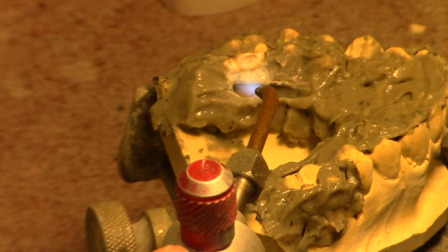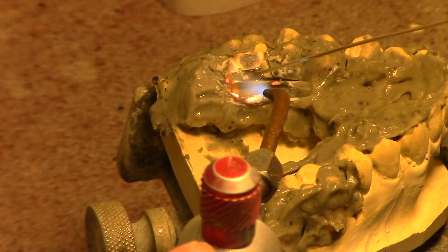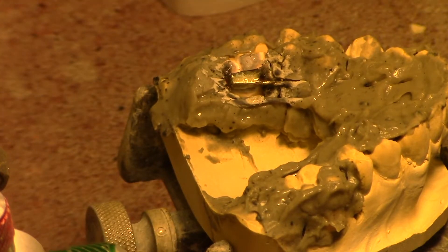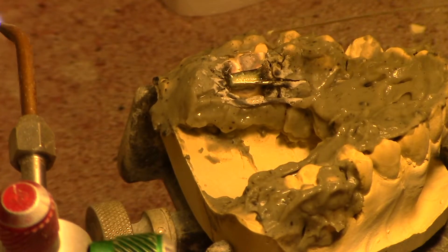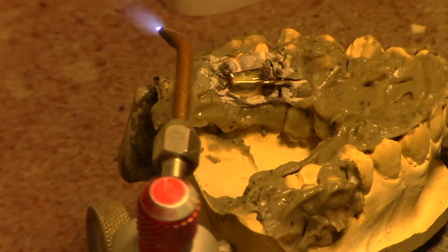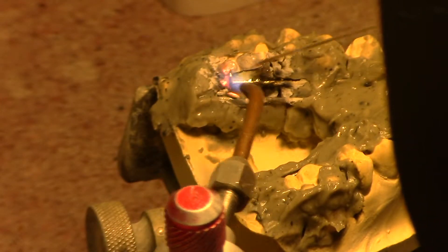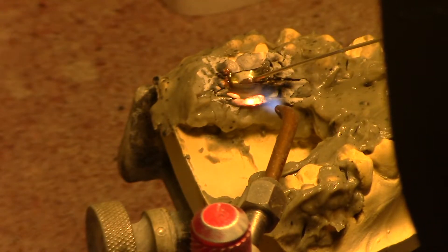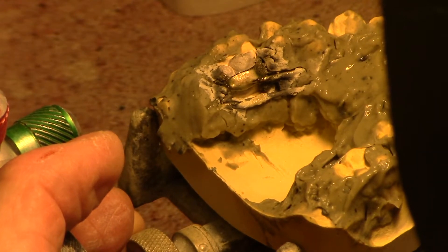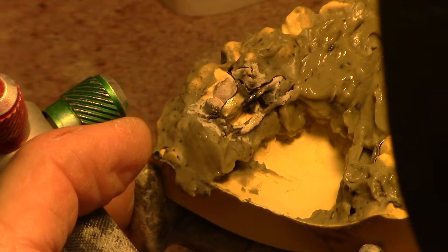I'm going to put my heat back and forth over it, let the flux melt, and as soon as the metal starts to get a little red I'm going to get some solder on there. The initial solder went on — I'm going to move the heat around. The solder has sweated onto the solder area, so we have that diffusion zone already occurring. I'll add a little solder on top, just enough heat to melt it. You can see the solder has that gelatinous look we talked about. It's sweated well and coated with low-melting temperature solder — that joint should be pretty good.